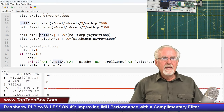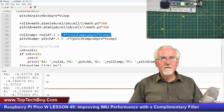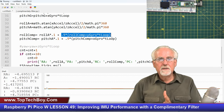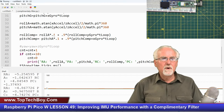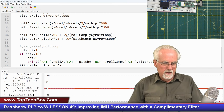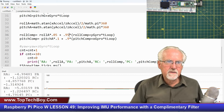All right, well, why do we have the noise problem? Because I'm leaning on the rock too heavily, and I'm not leaning heavily enough on that short term where that noise comes in. I should be leaning more on this one and less on this one. So let's say instead of 0.1, what if I said 0.05? Okay, it's still there. My rock is still there. But I'm going to be giving more weight to this combined value. Okay, so now let's try that.